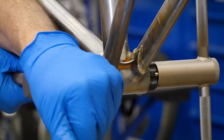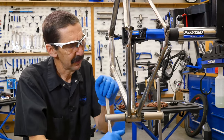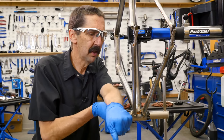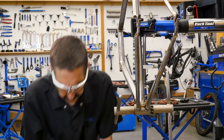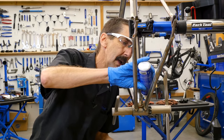What we're going to do with these is just bury the face of the tap, because that tap is going to act as a guide for facing. So I just need to get that just a little below the surface here. Now this side is going to need to go in as well.